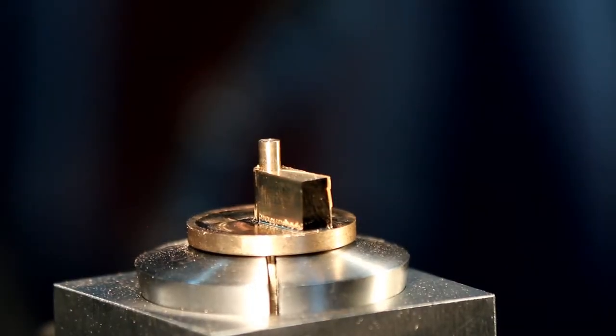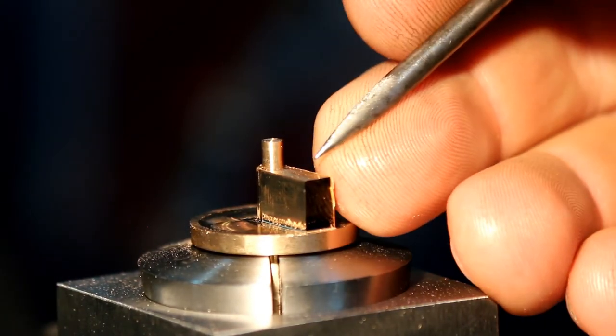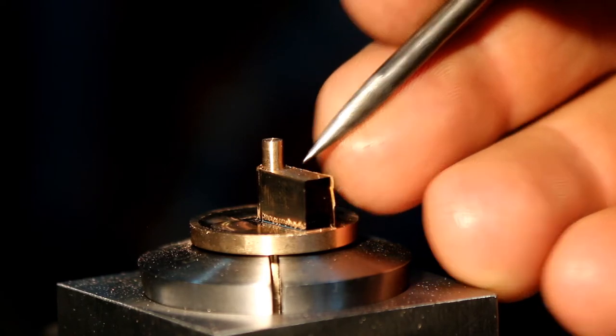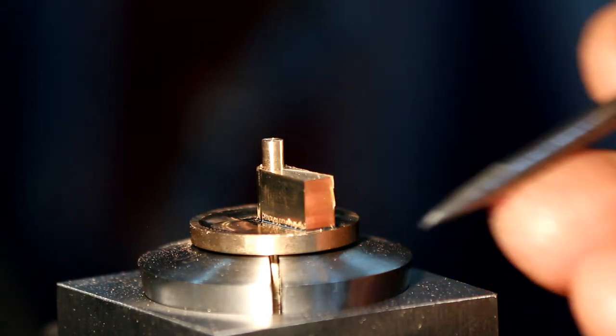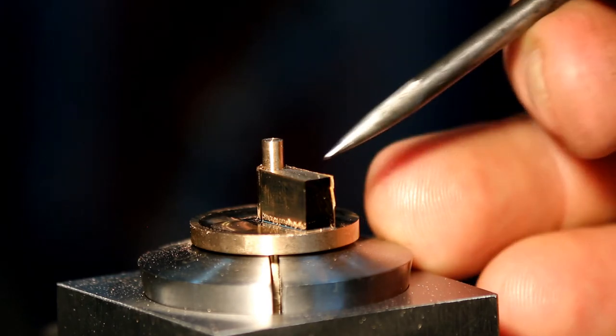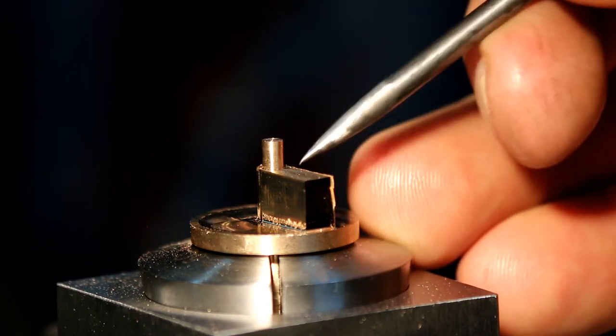Okay, so the milling's finished. This radius has come out really nice. I just need to put a 1.2 millimeter hole just back from center, around about here, and then I'll take it out and I'll cut this off with the hacksaw and the vise, and then, maybe before I do that, I'll spend a little bit of time breaking any burrs that are around here, and then I'll put a parallel strip along this face here.